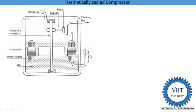Here you can see that in the motor, the copper tube winding is directly supplied. This winding is open. When the motor is in the completely sealed unit, the motor is heated. So how is this heat energy rejected? This heat energy from the motor is absorbed by the oil — it is known as the cooling oil. The refrigerant from the evaporator comes at low pressure in vapor state, and it passes through the winding of the motor. This refrigerant also absorbs some heat, and refrigerant superheating is done. Then it is supplied into the compressor, where the compression process takes place, and then it is supplied into the discharge line and goes into the condenser. This is the complete working of the hermetically sealed compressor.